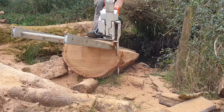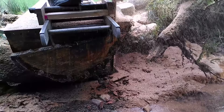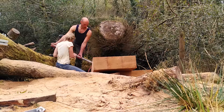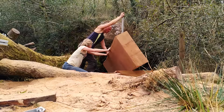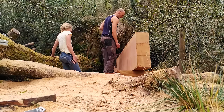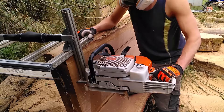What about metal and concrete gate posts? Longevity-wise they can actually be a good option — if you are the one who installs them, it's unlikely you're going to be the one to have to replace them; in other words, they'll last a lifetime. My primary bias against them is cost, both in terms of dollars and environmentally — unlike oak, chestnut, or cedar, they neither grow locally nor on trees at all. On top of that, they can be a bit fiddlier to install. Having said all that, as an off-the-peg solution if you don't have wood like this on your property and you don't want to be replacing posts every five to ten years, it might well be a better option than pressure treated posts.